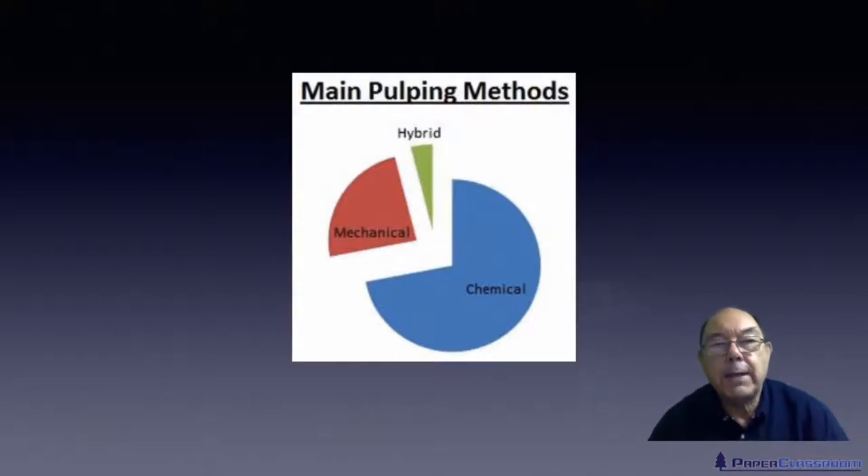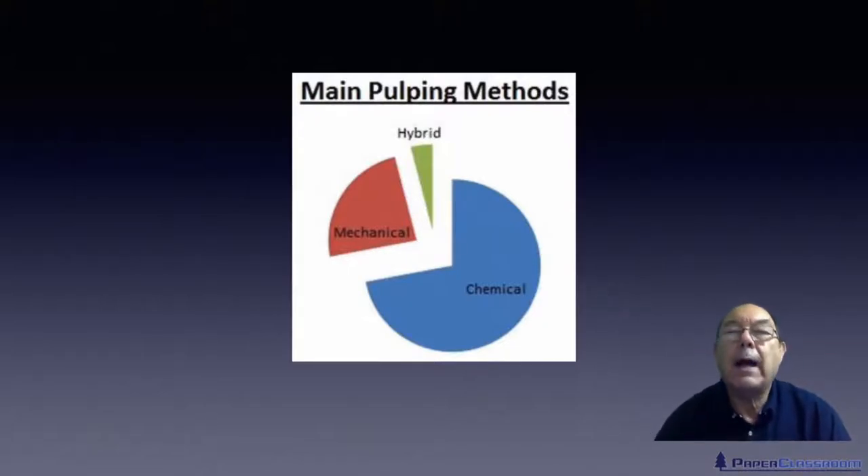About 25% of the world's production of fibre for papermaking is done by the mechanical method. Very approximately 75% of pulping is done by the chemical method. And there's a little bit of what we call hybrid pulping. With hybrid pulping you take some chemicals, impregnate the wood chips with chemicals for a while, remove some of the lignin, and then finish it off in a traditional mechanical way by passing it through a refiner. Hybrid pulps contain a lot more lignin than chemical pulps, but not as much as mechanical pulps. There's not a lot of hybrid pulping left — just maybe 2, 3, 4% in the world.